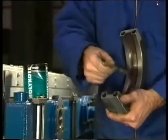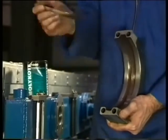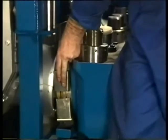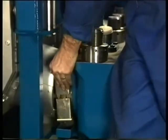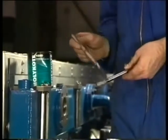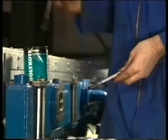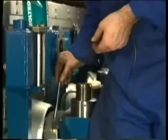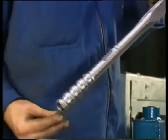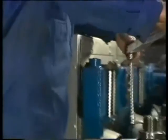You can start for example with mounting at the exhaust side. For this purpose, grease first the inside of the upper exhaust clamping ring with a heat resistant lubricant. Subsequently place the clamping ring over the exhaust flange and mount it with the four socket head screws. Treat the screw thread of these bolts also with a heat resistant lubricant as specified in the instruction manual. Then these socket head screws are tightened to a specific torque. This torque wrench is a standard delivered tool with the engine.